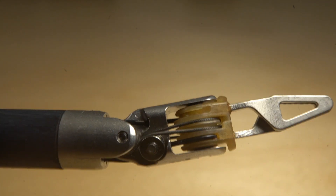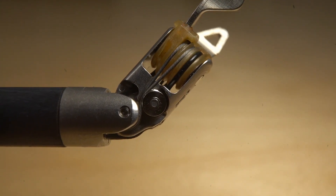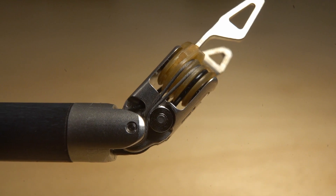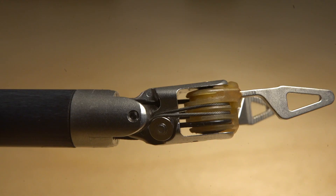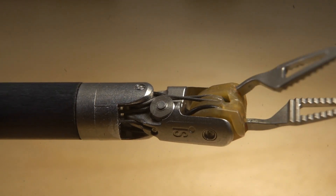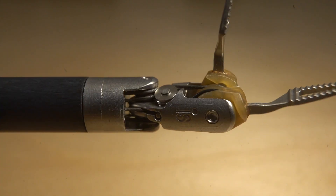The bipolar instrument is neat because the most distal wrist joint is made of plastic instead of metal, to insulate the two halves of the gripper from each other and from the rest of the device. Since the radius where force is applied is so small, forces on this part could be relatively large, so it's probably some sort of high performance plastic. Since it's orange and partially transparent, I'm guessing it's a glass-filled PEI rather than PEEK or PAI, though I couldn't know for sure without chemical analysis.